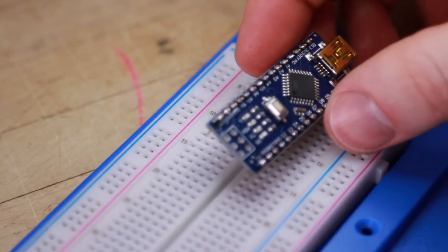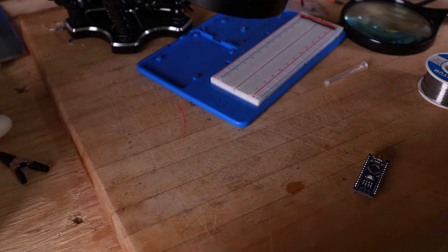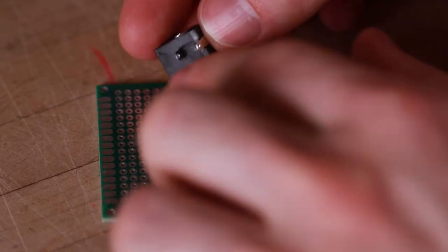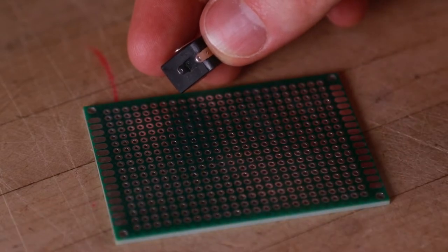Now I'm going to clean this off with a little isopropyl alcohol. Now to lay out the board. It's going to be a little bit tricky to attach the barrel jack to the board. So I'm going to drill out one pin, and then I'll bend the sleeve tab underneath and solder it regularly on the bottom. I think it's about time to try out Cthulhu.